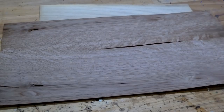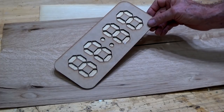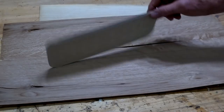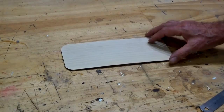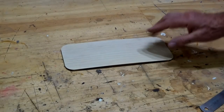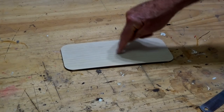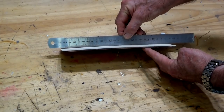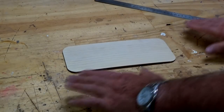I made up this test piece. You can see the laser-cut openings for the seven-segment displays in the back. That looked pretty good, and I was able to test out the LEDs behind that. Now, there is a bit of an issue with putting veneer on a very thin panel — it doesn't matter whether it's MDF or plywood or solid wood. As the glue under the veneer dries, it exerts a force on the substrate and what you end up with is a curve. You can see it's quite a distinctive curve in the face — we don't want that.